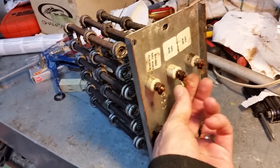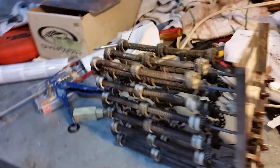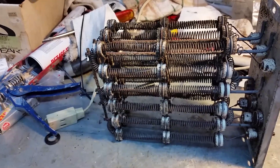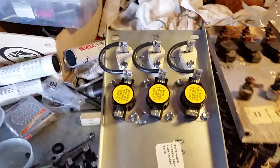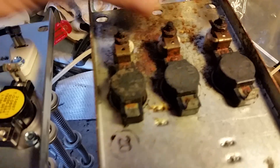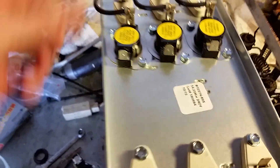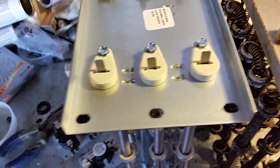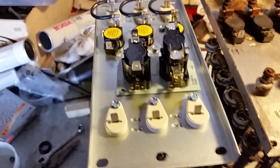Mine were not kicking in due to all this corrosion and rust. I decided to go ahead and change out the entire heat strip assembly because they were so rusted the screws weren't going to come off without stripping. I need reliable heat especially because we leave and go out of town for 30 to 60 days at a time, so I need to make sure everything is working. While I'm under there I'm also going to change out the sequencers.